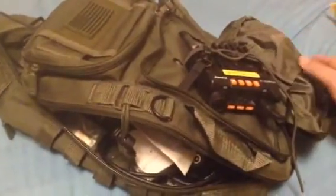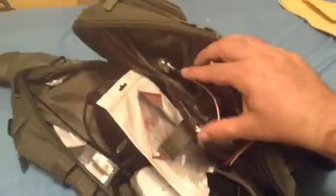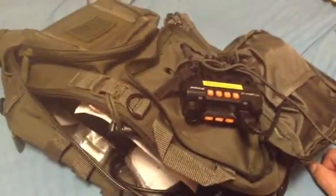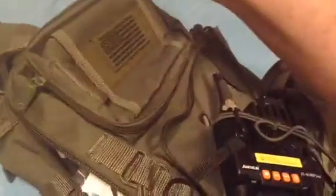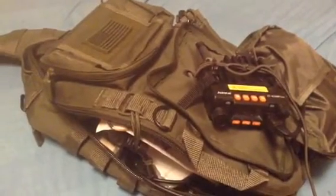The idea is to take the bag off and turn the radio on, maybe set the antenna up. What's plugged in on the rubber duck setup is just a one-foot cable. This 18-inch rubber duck — it hasn't been clear to me whether it can really handle 25 watts. If I transmit 25 watts through it, would it overheat the radio, scorch something on the antenna, or would it just be less efficient than a larger antenna? I don't know. If somebody has recommendations for a flexible, whippy antenna suitable for this radio that would still fit in the bag, that's what we're looking for.